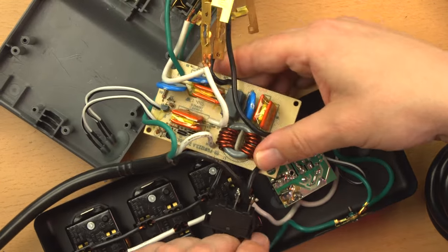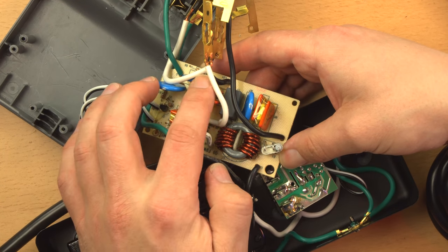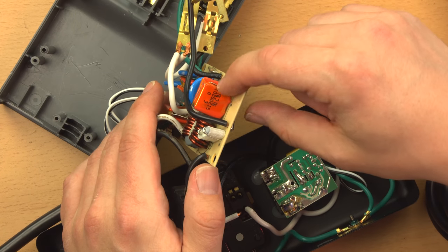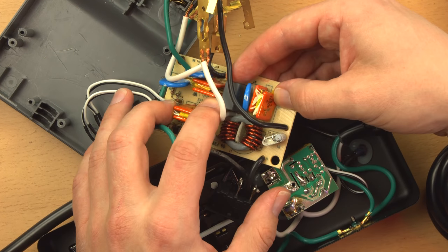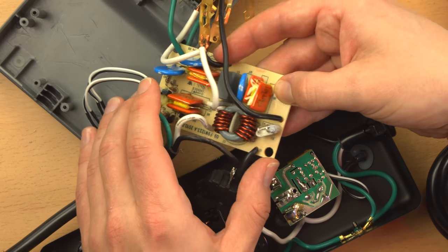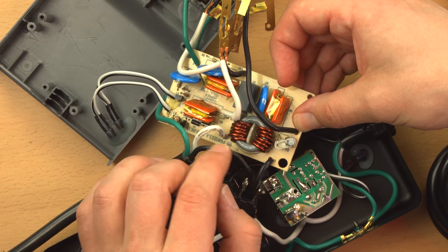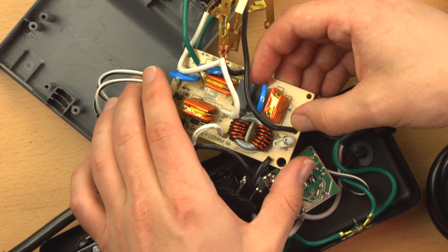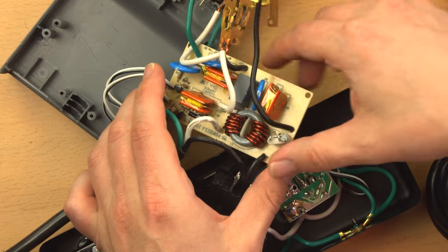You know, because this has a big choke on it, a bunch of, well, three metal oxide varistors. I am not sure at all. I looked everywhere on the internet for these components right here. They look like metal oxide varistors. They're being used in an application that metal oxide varistors would be used. So if anyone knows exactly what these are and what their specs are, I'm curious to know. But those are thermal fuses in between them, so if they overheat, it'll completely cut out. That's nice. There's also a capacitor in here, I'm assuming for high frequency filtering. So again,